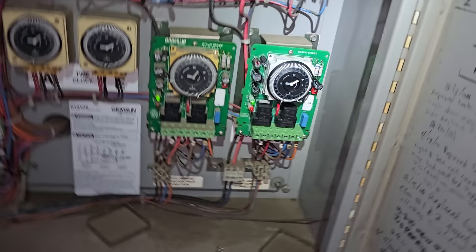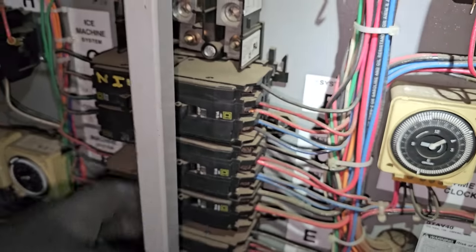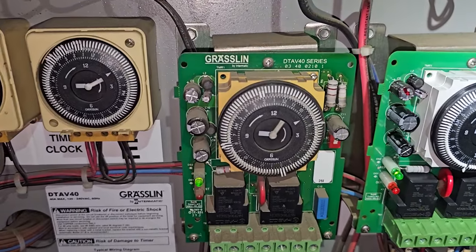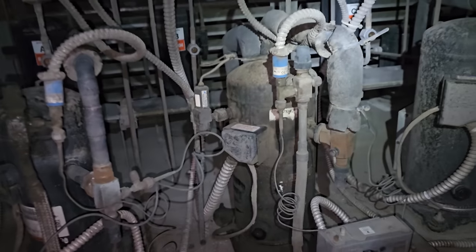This is my rack. My walk-in freezer is right over here — that one right there. Let's open this up. Walk-in freezer should be system B. Breakers are on, we're not in defrost. Doesn't sound like it's running. That's not good. Compressor's really, really warm. That's really not good.